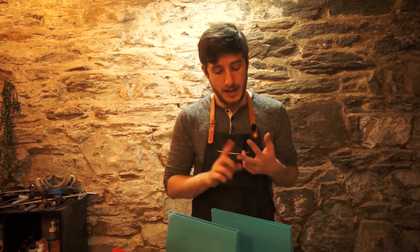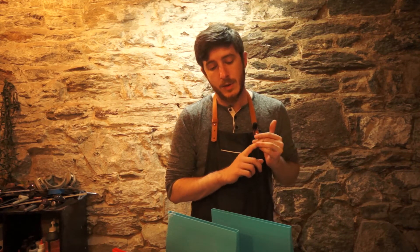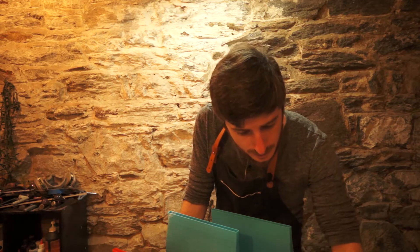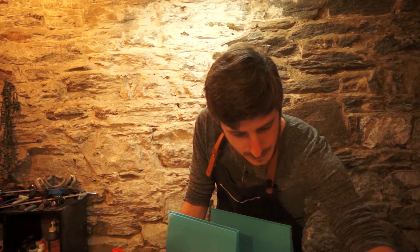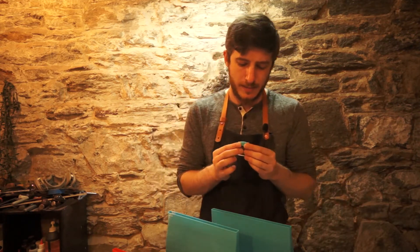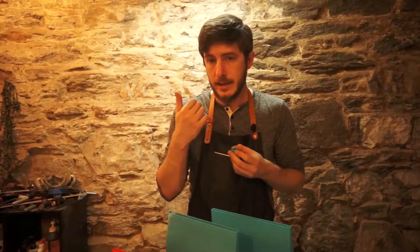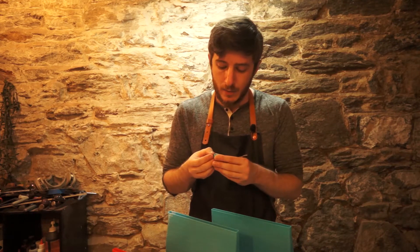It was a little disappointing because I was hoping to crank out parts fast, but pushing enough plastic for tall layer lines was problematic. After the cubes I knew I wanted a hollow part. The letters on the cube surface were affecting flow rate at corners, and I knew the actual parts would be big with rounded corners and no surface details, so I made a little test cylinder and did a bunch of further fine-tuning. I printed two walls on the cylinders, but I kept running into a problem: the inner wall and outer wall weren't touching, indicating under-extrusion and a mismatch in wall thickness.